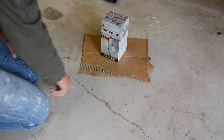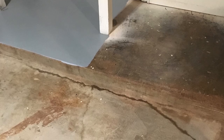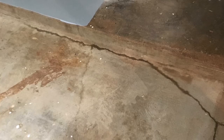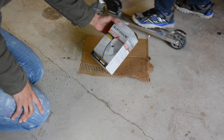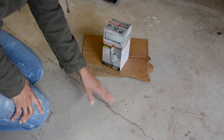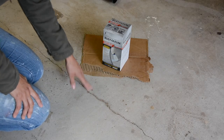When I first started cleaning this floor, I didn't even realize the extent of these cracks. Once I actually saw how the water just kind of laid in these cracks and it took a long time for them to dry, I decided I've got to get some concrete patch and repair and make sure that I repair this first before actually painting it.